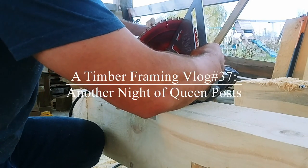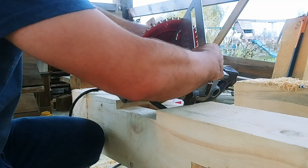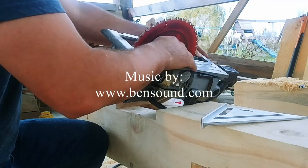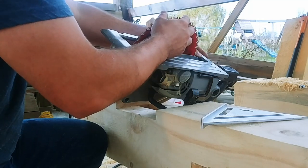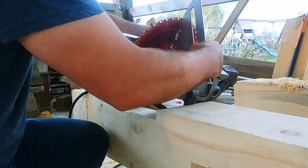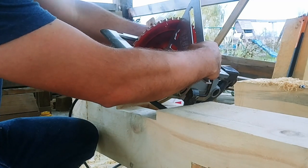these saws comes out of that toolbox, I check that blade for square. Now, when you're checking your blade, obviously you're checking against the deck of the saw. Don't rest your square up against that tooth and square up to the actual carbide tooth. Go in between the teeth. That's going to tell you if the blade itself is square or not. And that's good and square.